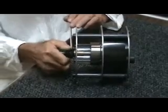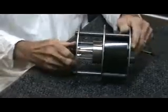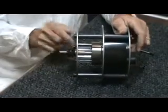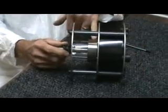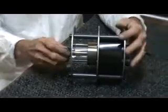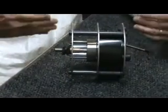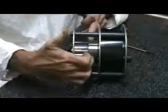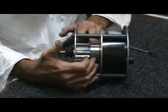Spin the top down to it and tighten it. I have a very small space at the top. This is floating on springs, so we know that our upper and lower bearings are in alignment — the axle is just sitting on those two bearings and is free to move to align itself to the inner burr.